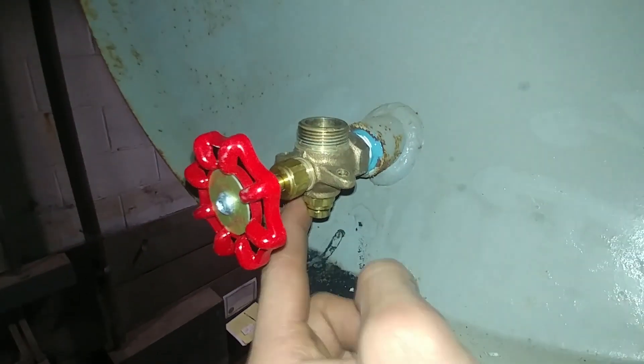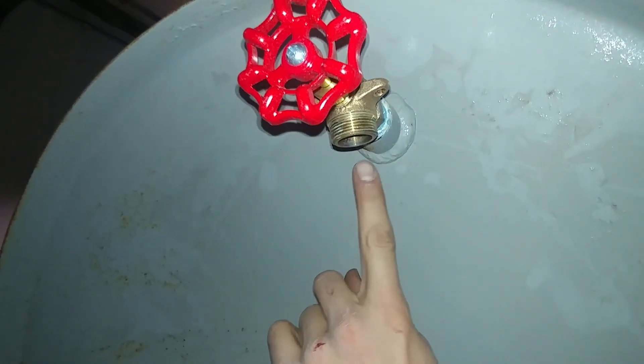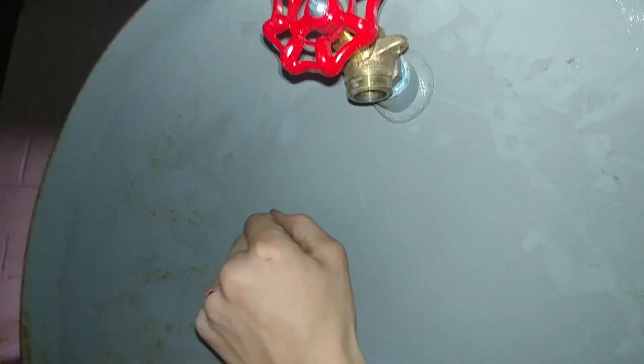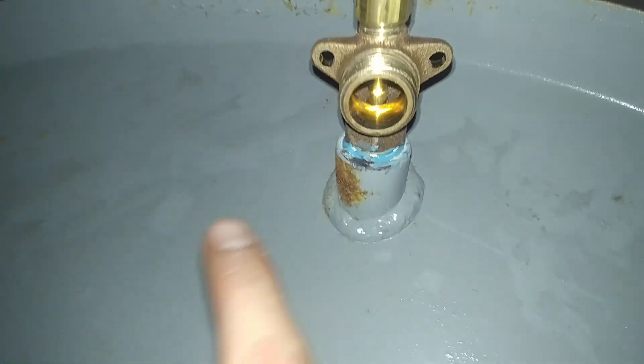This is the bottom fitting. The bottom fitting has a drain on it, and the top fitting does not. What you want to do is get your bottom fitting tightened in so that it's facing perfectly up, and you want your other one to be tightened in until it's at about a five o'clock position, so that you can stick the glass up into there, and then tighten it just that last bit, and then drop it down into the lower fitting. This top one allows you to stick the glass in pretty far, while this bottom one only allows you to drop it in like a quarter inch.